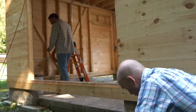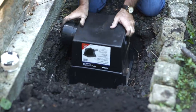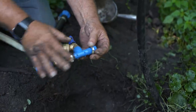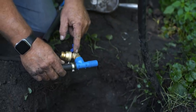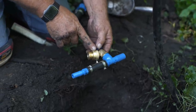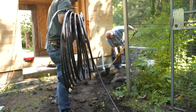Hey Mark. Heath, how you doing? Good. A little ditch digging today. Let me know if you need anything. I'm going to cut this off and make this connection right here. It's got a stainless steel clamp that I'll use a special crimp tool on. And I'm going to leave down in the box this hose connection for the supply onward. But a very important point I've added is a thing called a vacuum breaker. We want to be careful that if this was in a bucket or something, we could never have any back flow to contaminate the water supply. And then I'll continue on with our supply to the new coop.